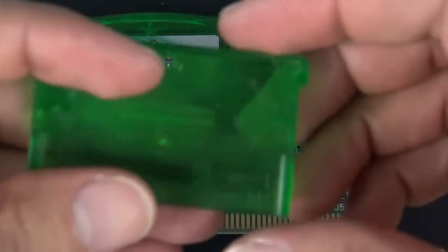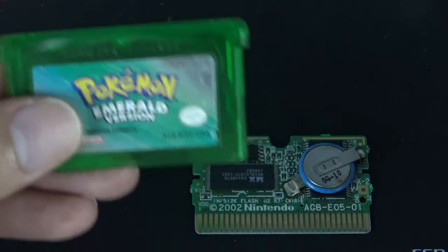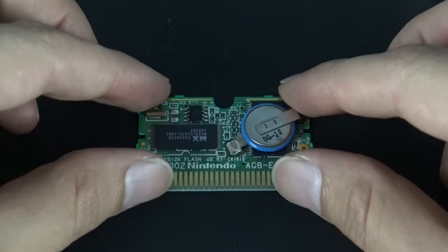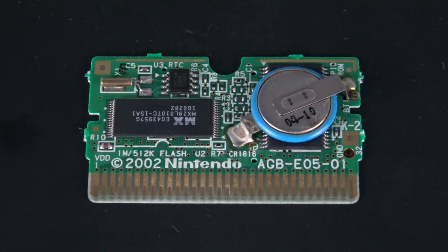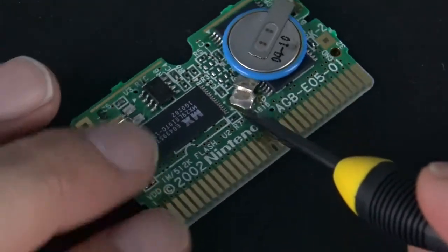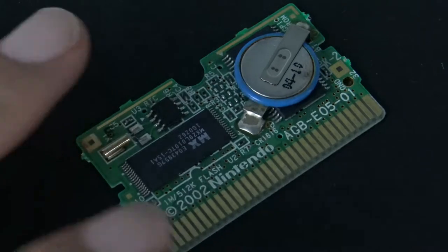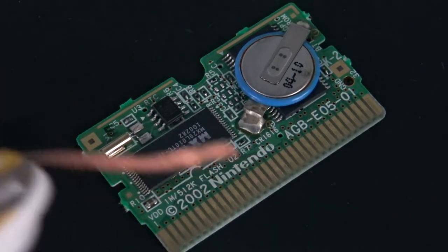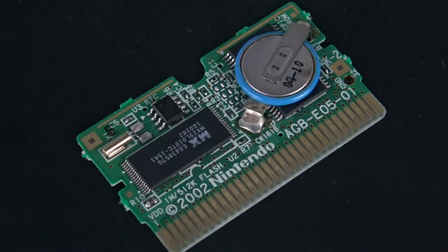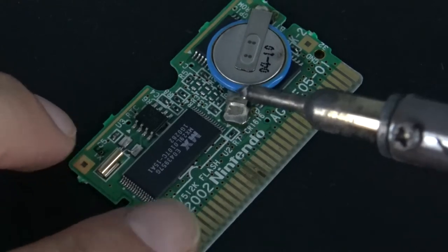What I ended up doing was taking the bottom piece out because I don't want to burn it while I'm trying to solder. We're going to take that out and get rid of this one too because we do not want to break or burn it. I'm going to start off with this side right here — hopefully my soldering iron is hot enough. I'm just going to place it here, get it a little melted, and then using this I'm going to try and suck up that solder. If that doesn't work, I'll use the desoldering wire.